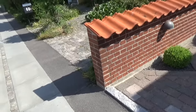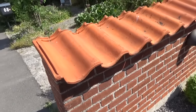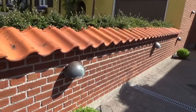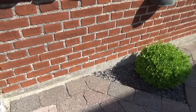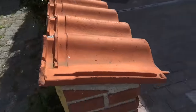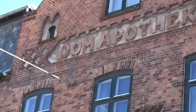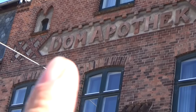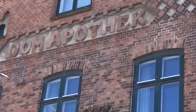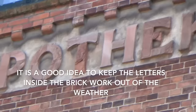Here's another version of that brick wall. They've got tiles on top, and they laid a brick. On the very bottom they've got it so the rain doesn't get up into it. Look behind the wall — they plastered it and painted it. Here's another good thing to consider when you're doing a sign like that with letters on it: you inset it, so it's not hitting the weather all the time and it won't wear away.